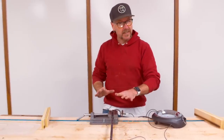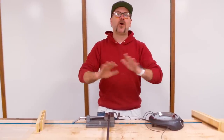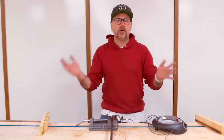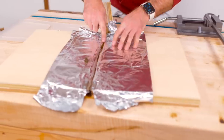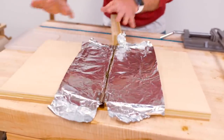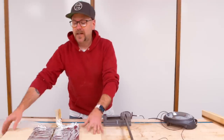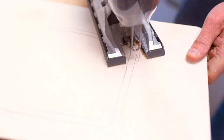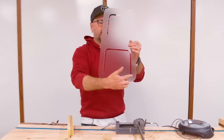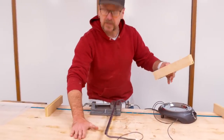Now you've got to be careful — this is super hot, super dangerous. Things could catch fire, you could get electrocuted, you could get burnt. There are plenty of jigs and DIY jigs you'll see online. I've tried them all. Here's one that we tried over here. We put the heating element in there and used it to bend the acrylic, but we found it really wasn't necessary. As long as we get a nice even heat on the sheet of acrylic, we can bend a nice straight line without the jig. So I've gone ahead and cut up some acrylic — I'll heat a line here and a line here, then bend this down to make a little wall hanging with two shelves.